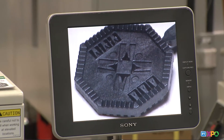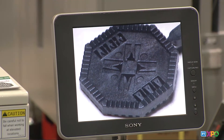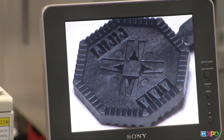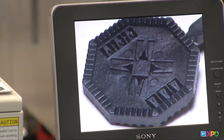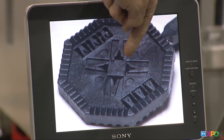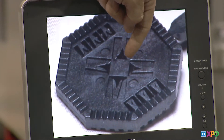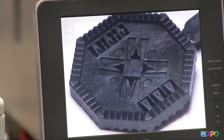In addition, there are wall sections in here that are under five thousandths — 0.125 millimeters across. If anybody is used to thinking of minimum wall sections that you can fill in a part, it's usually not four thousandths and eight tenths across. That's what we have at the minimum here. We're gated on one side and we flow through from the gate end through this region that's down to under five thousandths. It does not hesitate or freeze like you would traditionally expect, and it's still able to continue flowing and go through another thin region back into thick fill again.